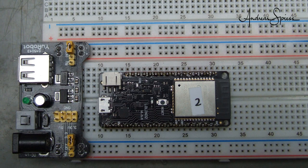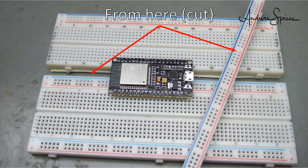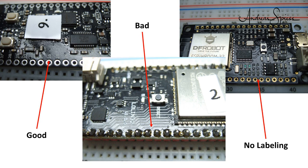Next, you find the information on whether the board is breadboard friendly. I call the boards breadboard friendly if they leave one row of pins to connect your wires. I know there are tricks to use wider boards on breadboards, but they are not very stable. In this respect, another criterion is important: how are the boards labeled? If the labels are on the bottom side, you cannot read them if your board is on your breadboard — not very comfortable.